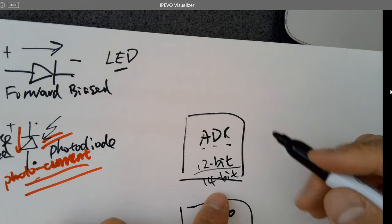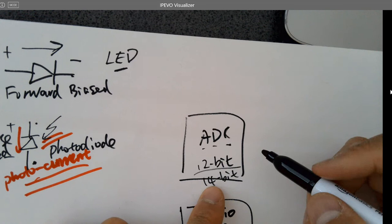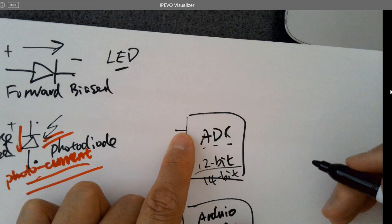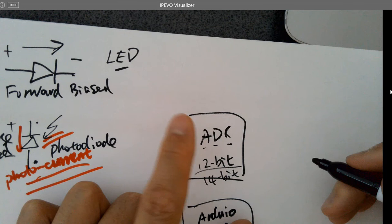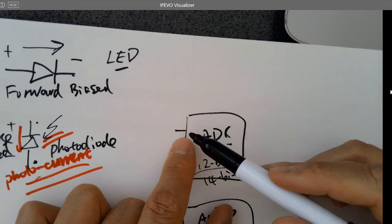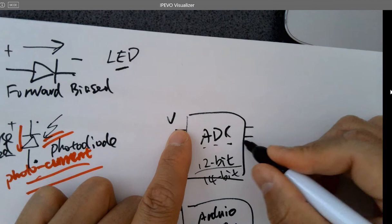So way better performance. And now you want to digitize this light signal, all right? You've got an ADC. So what is this ADC converting? Is it able to convert a current? If you have designed or simulated the ADCs you have used, you know that ADCs are all converting analog voltages to a digital version of the voltage, but not current.